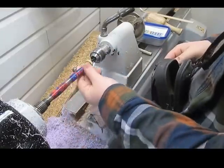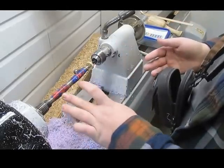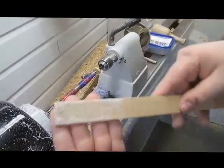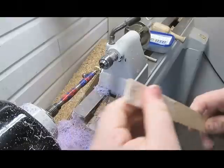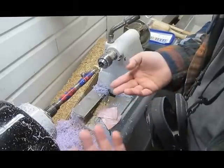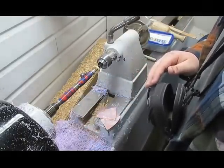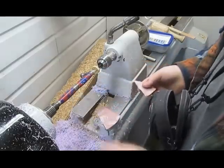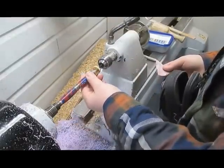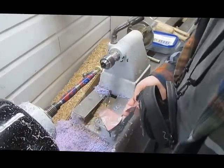Do not put a polyacrylic finish on an acrylic pen. I came out here this morning — it's been a full night since I applied the first coat — and it's real chalky. I think it's because it's about five degrees out in my shop with no fire going in the stove, and it's just too cold. The stuff is freezing before it's drying. So I took 800 grit and sanded it all off. Plan B — and this never occurred to me — you don't really need to put a finish on acrylic because it doesn't wear like wood. I'm just going to go through my micro mesh again to give it the shine. Maybe next time I'll try a CA finish and see how that works.